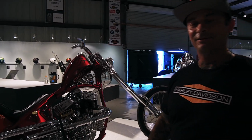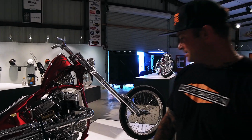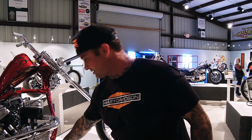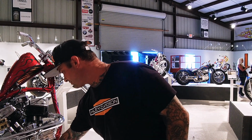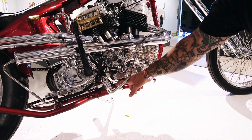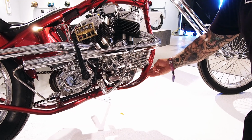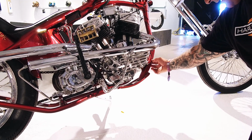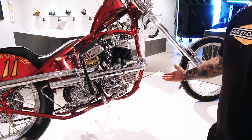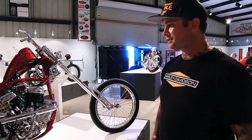So, got a flat skid plate on the bottom too. Yeah, that's the 45 frames, they had this style right here, and the VLs, and you can see the bottom of this seat post right here. It was cut off right here, so what we had to do is make the plate here, add a section of tubing here, run everything down, and then make our motor mounts and give it that flat bottom. Just a tip of the hat to those dudes back then.